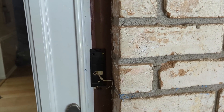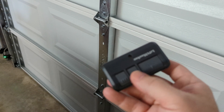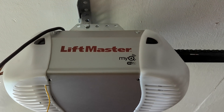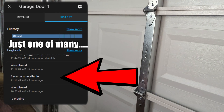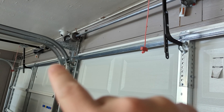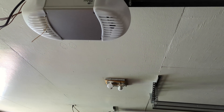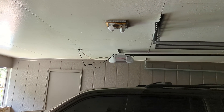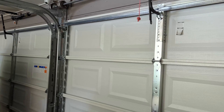With the spare opener, that's probably what I'm going to do — use it to actually actuate the doors without dealing with the MyQ cloud nonsense. It was actually down the first day we got these, so I'm giving that a huge pass. I'll run an actual door sensor on each side, and I'm thinking of mounting a project box with some sensors to detect vehicles pulling in — maybe a little ultrasonic sensor. I've seen some projects done with those, so I'll try the full automation deal.